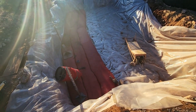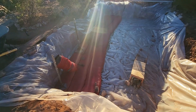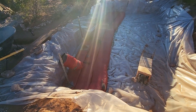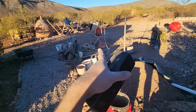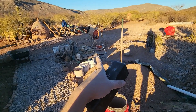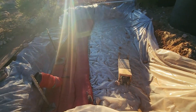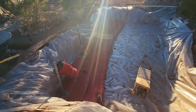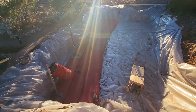We are wrapping up day one on this. We got 3,000 pounds worth of dirt — these are about 1,000 pounds apiece, 20-foot long, 18-inch bags that are 4 inches thick. Calculate that by our cement, which is 10%, so 100 pounds — each cement bag basically covers 1,000 pounds of material. We're going to crank on this for another half day tomorrow. I'm guessing about 8 weeks on this project to get the bag work done, and then another roof.